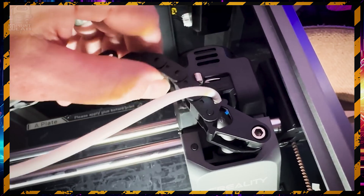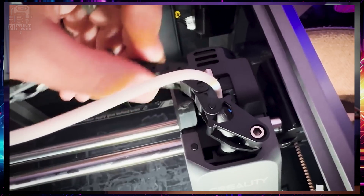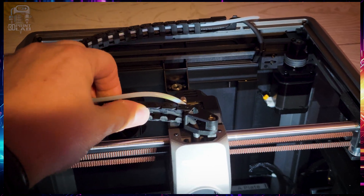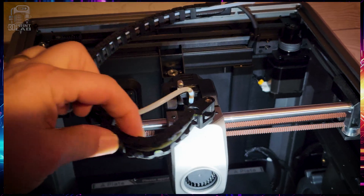One of the biggest early problems was the drag chain sliding over the top of the extruder and flipping the switch that disengages the gears. That's one of the reasons for the new extruder and the upgrade kit. But they also implemented a fix that honestly should have been caught early on — they just reversed the direction the drag chain flexes. So now instead of flexing inward and flipping the switch, it flips outward and everything works perfectly.